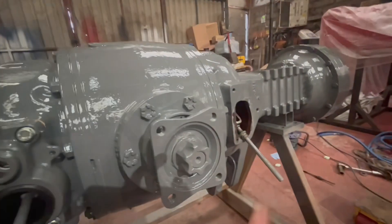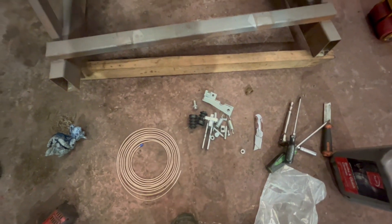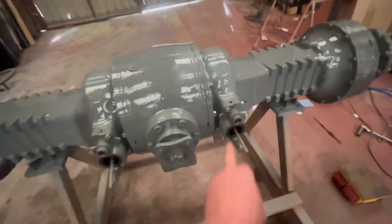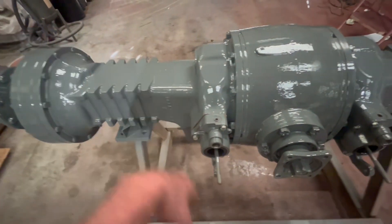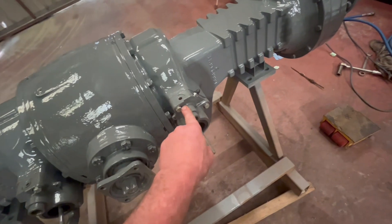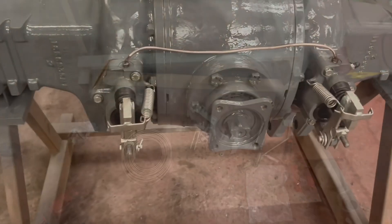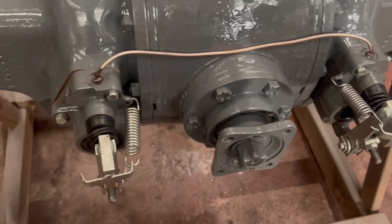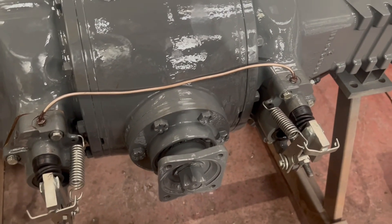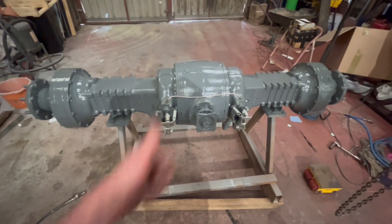We can sort the brake pipe out when we've done the other one. We've got both those fitted on there. I've been on a route round in my stores and found a load of other bits in my random spare parts stuff, so we can put all that together, make the link pipe that goes from there to there. Put a blanking plug in that one until we eventually get this back in the chassis, which won't be for a while. New bleed nipple on there, so we'll get busy with new boots and pipes and levers and things. There we go — like brand new. Springs, levers, just need to find another locking nut for those. New pipe put in, a bit of copper slip on there so if you need to get apart another day, it shouldn't be seized in like they usually are. Yeah, one front axle — Massey 1250 — job done.